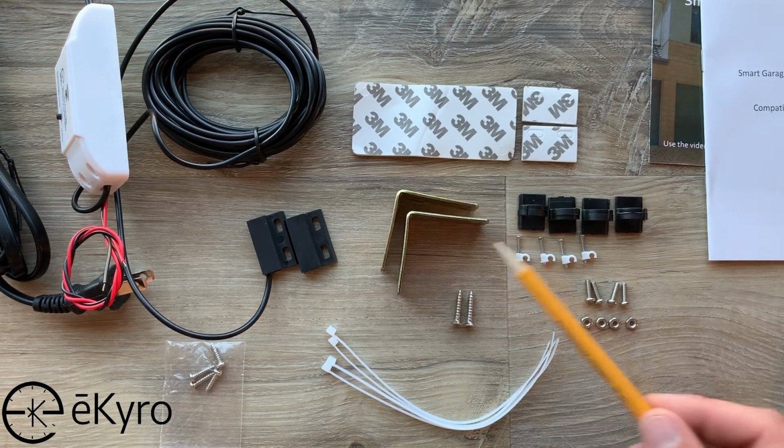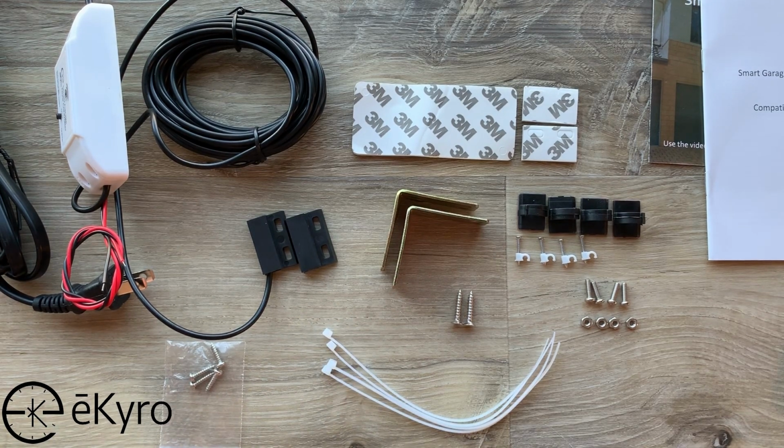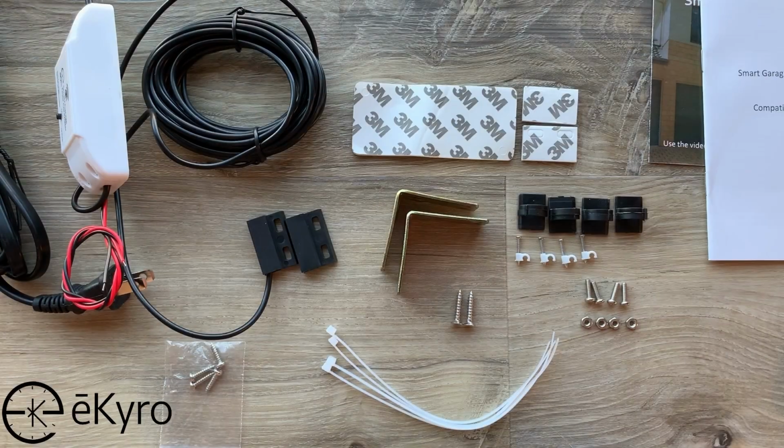We also want to point out that there are times where the adhesive pieces have failed, and that's either caused the wire or magnetic sensor to get displaced, which then causes false open or close readings. If the mounting surface is a little bit dusty, or if there's a scenario where the adhesive bond might be compromised, it might be a good idea to use some of the included screws.